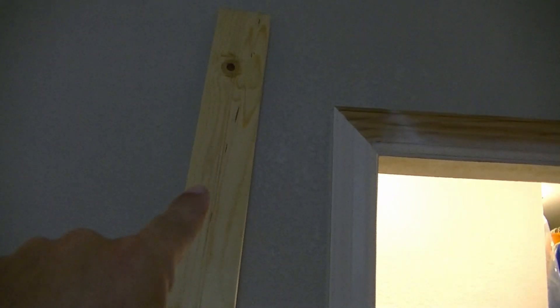So we're in the bedroom now. The next step is to install a board above the door frame for the track installation. The track does come with 16-inch on-center holes, but if your studs aren't 16 on center, you're just going into drywall and it'll pull right off. So I always install a board into the studs — there's a stud inside each side of this frame and one at the very end, I just need to find one in between. I put the door on a spacer on the floor, marked up where I want my board, and I'll level it, pre-drill, put the screws into the studs, then mount the track and hang the door.